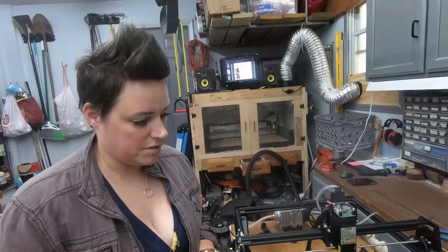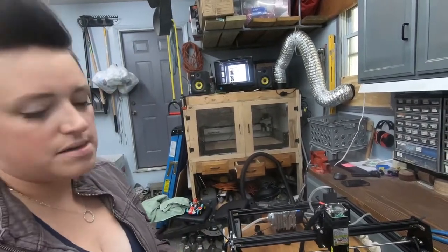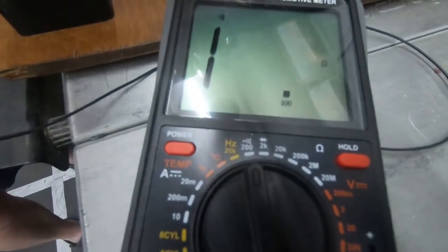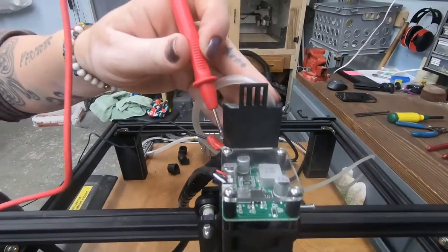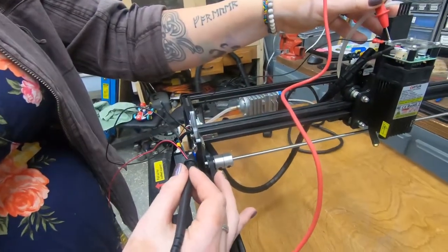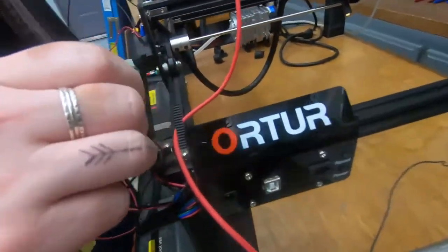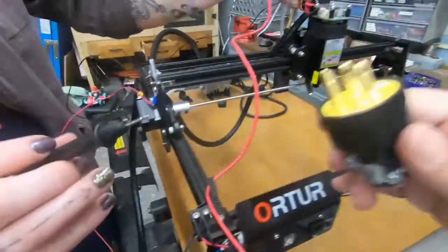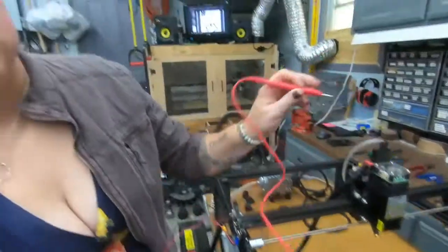We're going to get our harness plug back in and plug our ground in, and we'll pull out the multimeter and see how it works. We pulled out the multimeter and we have it set at continuity. We'll put one of our prongs up here where our first ground went in, and then we're going to touch our other points - if we hear the beep then we know it's grounded. It's grounded, and we should try it out now.